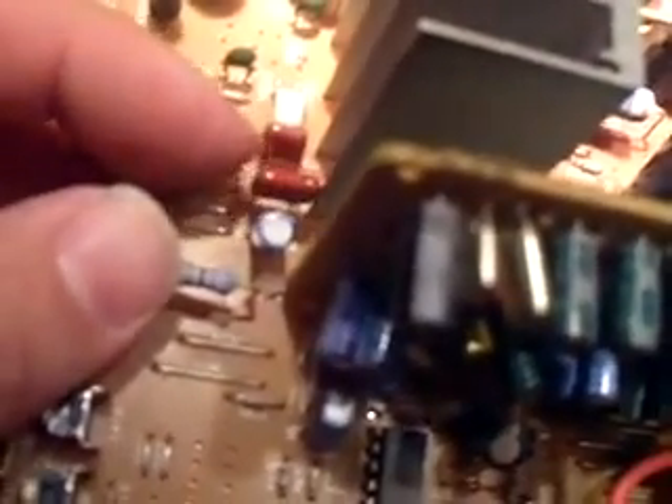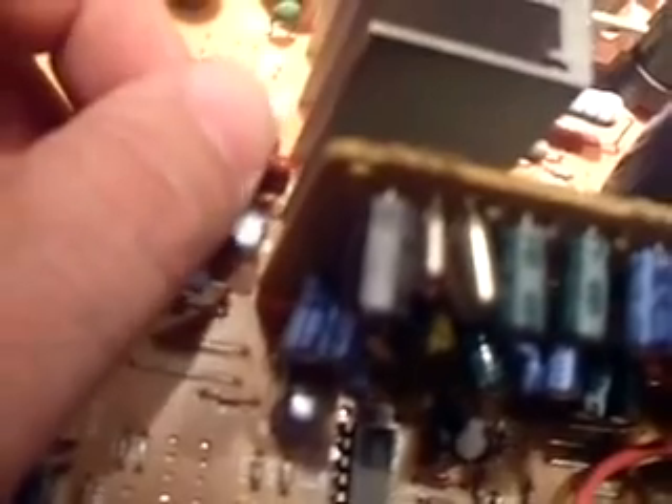These polyfilm capacitors are right next to the heat sink — I mean right next to it. So it's probably a good idea to replace those too. I just replaced this electrolytic: 10 microfarad, 50 volts. And I'm installing it, but I'm bending it away from the heat sink. The other one was laying practically on the heat sink, so I'm just going to bend it away to keep the heat off of it. I got one more electrolytic cap to do.